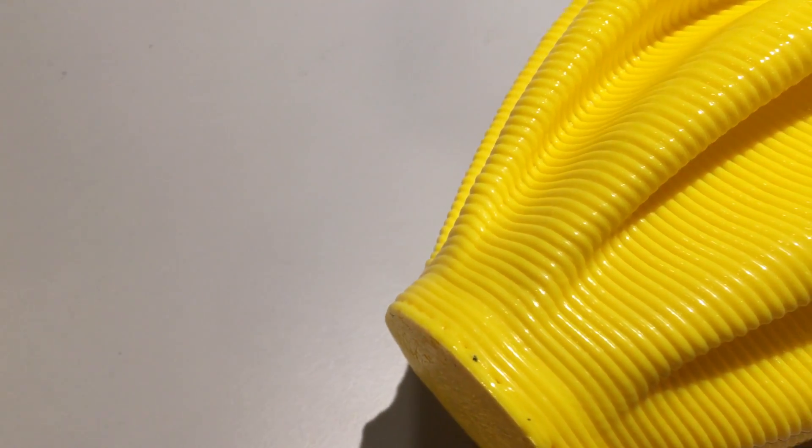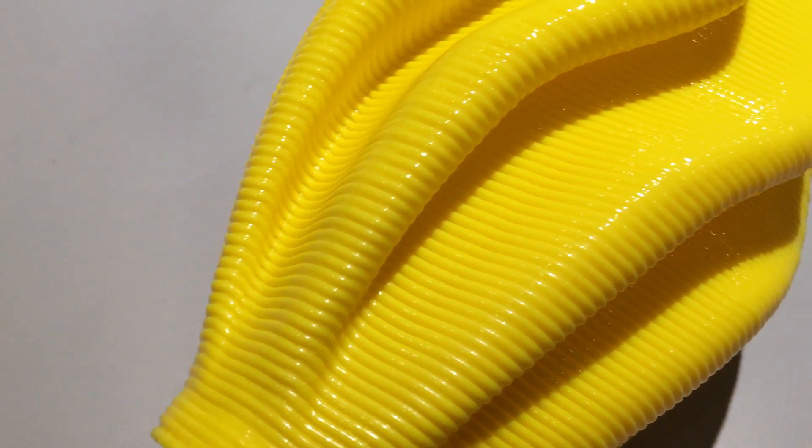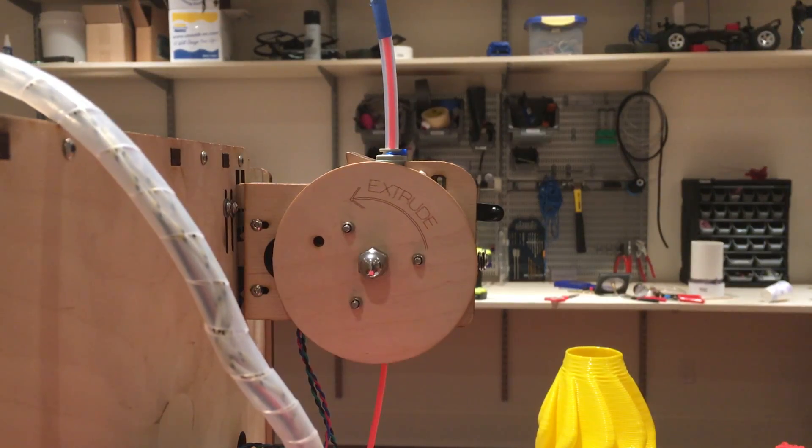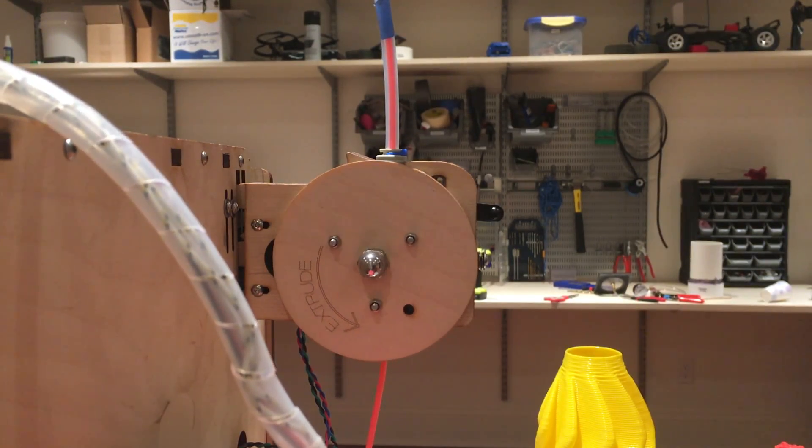With the nozzle, I've been able to print anywhere from the full 2mm down to just 1mm with reasonable results. In my experience, somewhere around 1.8mm works best. Other than that, the only other setting I altered was the speed. This is because when printing at high layer heights, a lot of plastic is being pushed through the hotend, resulting in faster extrusion and higher chances of grinding the filament. To fix this, I just cut all speeds in half.